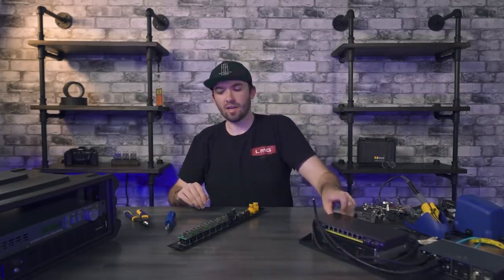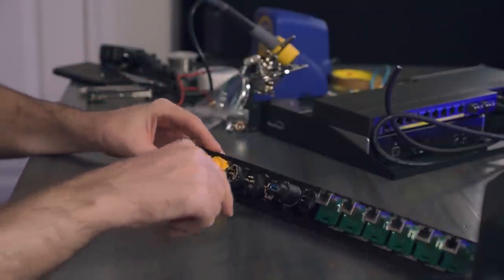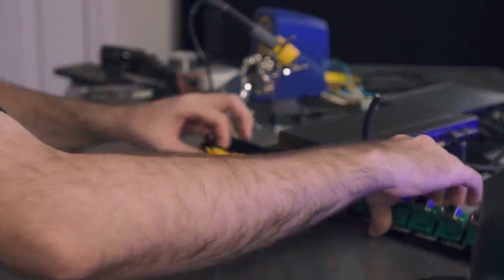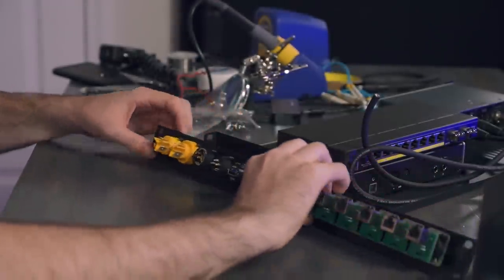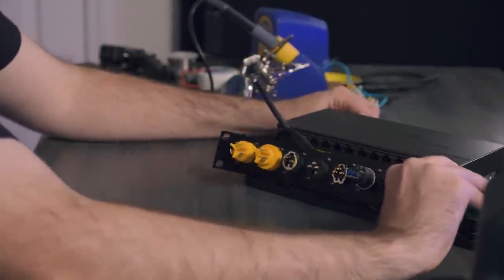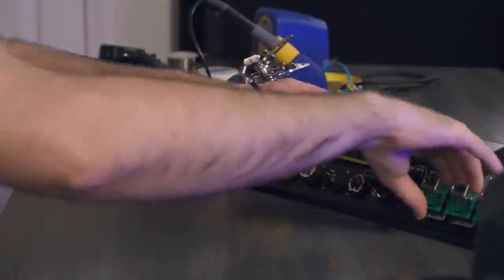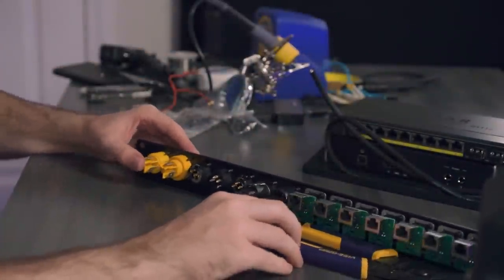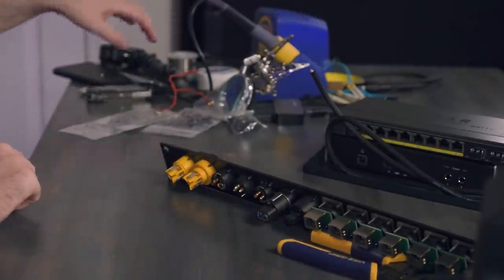And next up, while I am back here, I might as well tin the cups, as they say. So all these little holes for solder in here, those are the cups. And we will need to fill them up with some solder to promote adhesion. Oh my gosh. Can I please just find something to set this on that's normal-ish? This is silly. There we go. All right, so we're going to flip the soldering iron on.